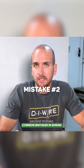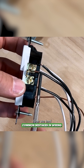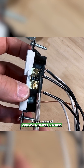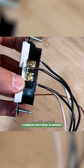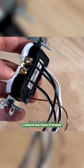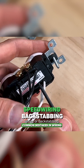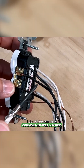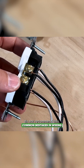When it comes to the second mistake, I want to focus in on the actual method for wiring this outlet. We have what's called side wiring, where we do a clockwise J-hook around the screw terminal. The clockwise J-hook is correct, and that is best practice. This is called speed wiring or backstabbing — it's only available for residential grade outlets, and I do not recommend backstabbing. Many professionals do not recommend this either.